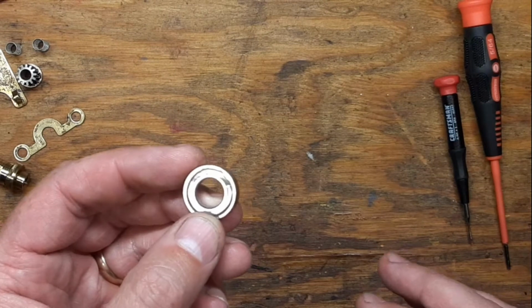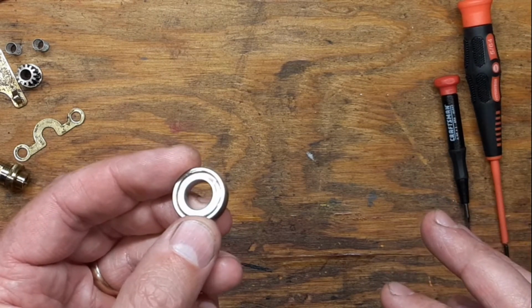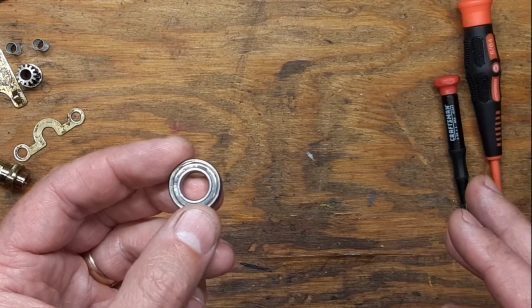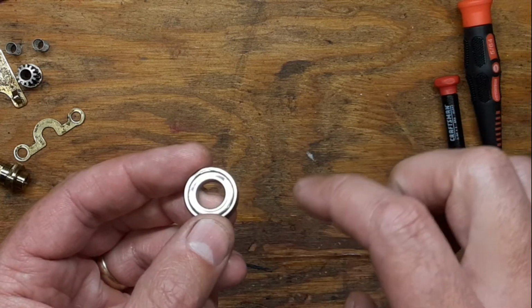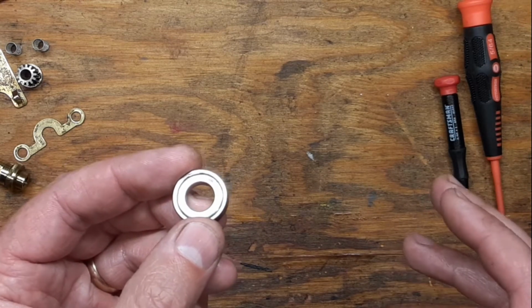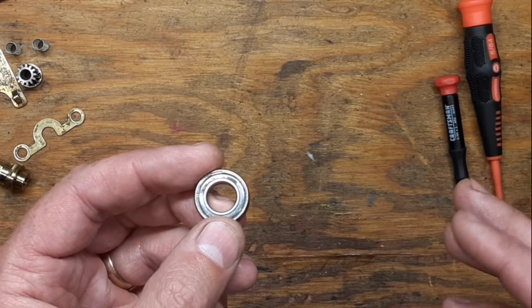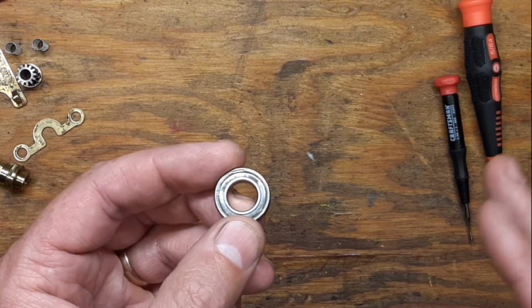There's different kinds of bearings. Some of them are open bearings that can be cleaned and lubricated. There's other kinds that are exposed bearings, but they have like a rubber seal locked in and stamped on them. So, you can see the bearings, but you can't actually uncover them, so to speak. And then there's others that are just permanently sealed and you can't do anything about it, and you just have to clean it up the best you can, and that's it.